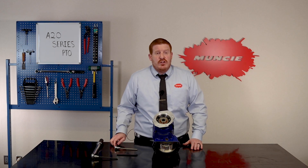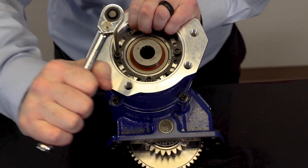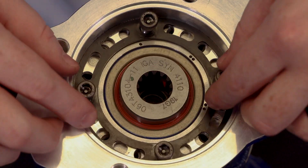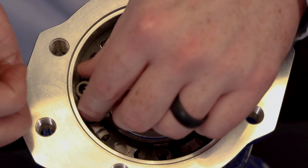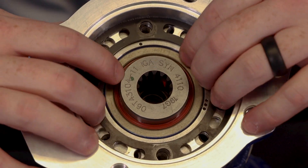This new flange is easily adjustable without any concern of damaging the shaft seal. To adjust the flange, begin by removing the four bolts holding the metal ring and flange in position. After the bolts are removed, you can easily rotate the flange until you have found the position ideal for mounting your pump.